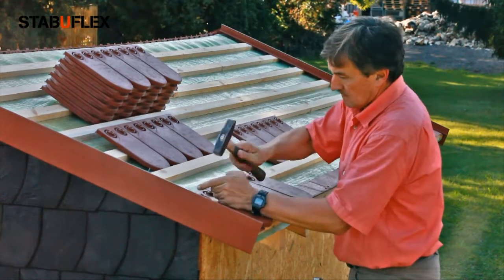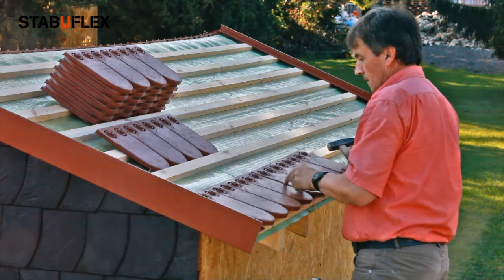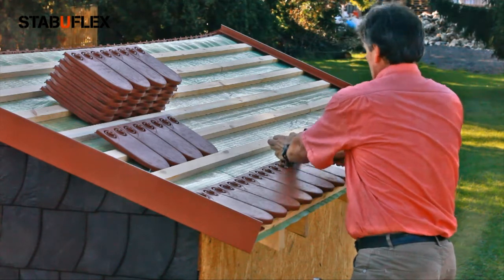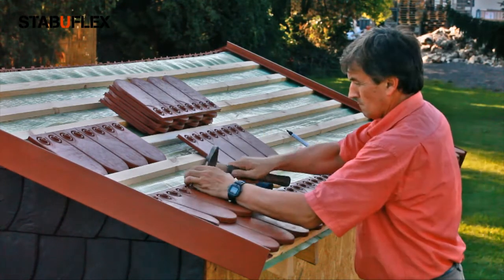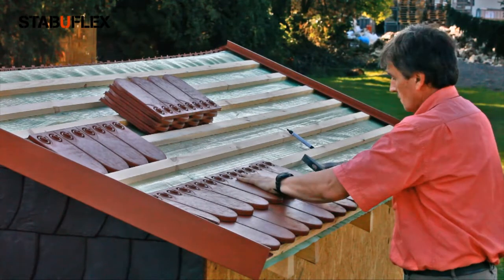The composite plates are to be half covered by the tiles you install after. It is recommended to put nails in the second and in the fourth hole. The slots of the first and the second row lie on top of each other. To fix the plates, a rubber hammer could be useful.